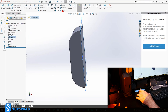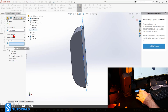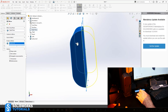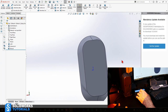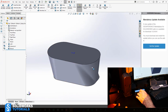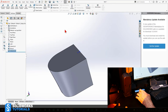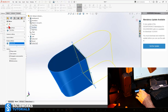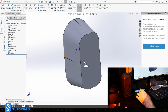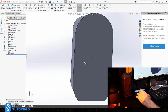Right Plane, go back to the Features tab, select Mirror. It's a body, so go to Bodies. If you don't know what a body is, watch my other video where I explained the difference between a feature and a body — link in the description. Select the body and click OK. Although I get this line in the middle, nothing has changed — the geometry is the same. I've taken care of that side. There's only one warp remaining and that can be fixed with another cut. Select this plane, cut it in half, and this time mirror it this way.